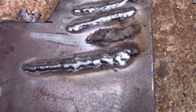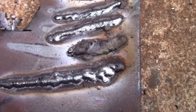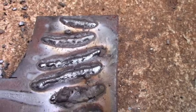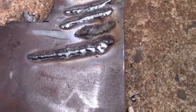These are the welds I just put down with the Chrysler alternator, and you can noticeably see that the Chrysler alternator is not as efficient as the Leece-Neville. It takes a lot more power on the field, and it loads down the engine a lot more. I had to bring up the RPM on the engine to compensate.